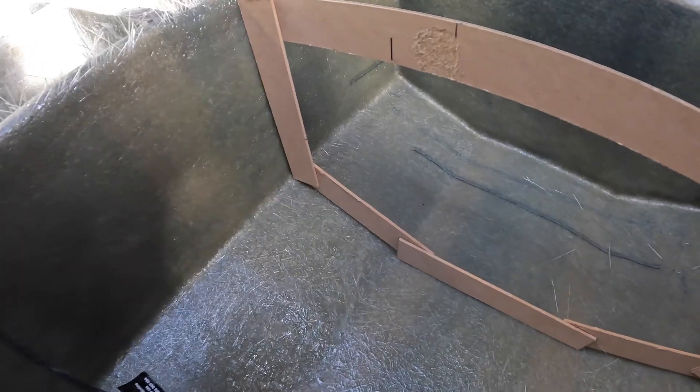The inside of the tank finish will just be vinyl ester resin, and I'll put one final coat of wax resin over everything before we seal it up, which is going to cure all the fiberglass correctly. There are reputable boat manufacturers that do fuel tanks like this, and I think it's a great way to utilize the space between the stringers and the hull so you don't have any wasted space. In my mind, if you do it right you're not going to have any troubles with this kind of tank.